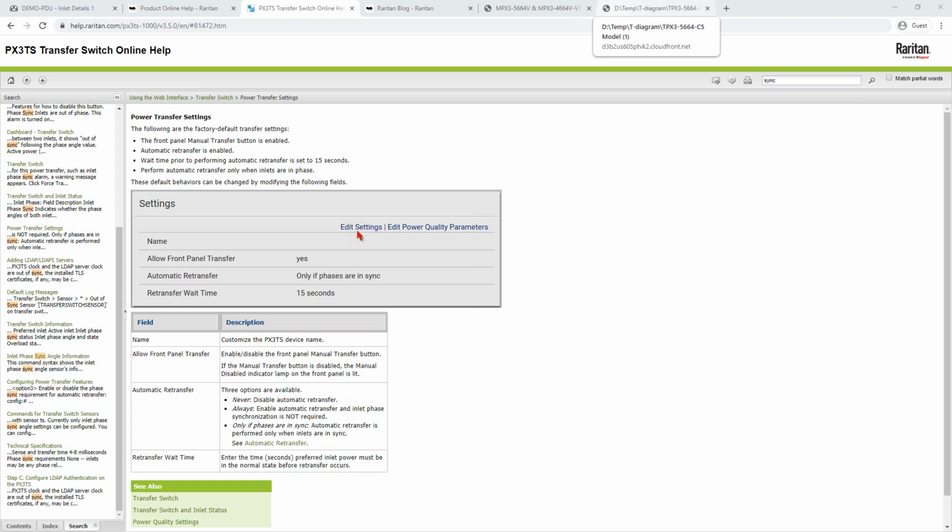Yeah, I can add a little something to that. For the most part, being able to synchronize the sources is a matter of the upstream equipment in the facility. Ultimately, it's done at the UPS level. That is, you need to have UPS systems that contain a feature generally known as sync bus. I think Liebert uses the term parallel bus. Effectively, it's technology at the floor level UPS stage where the UPSs share oscillator information between their inverter circuits. So they are independent with respect to the line currents and voltage, but they are sharing oscillator information for their inverters for the purpose of synchronizing the line 1, 2, and 3 outputs of otherwise independent UPSs. So it does involve a bit of upstream investigation. The PDU is simply reporting that it is presently not synchronized.